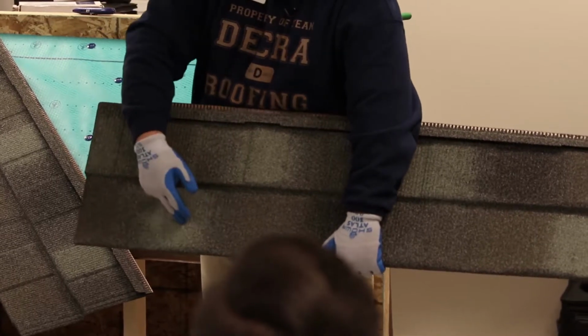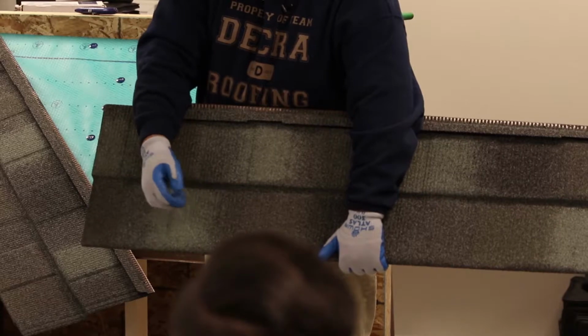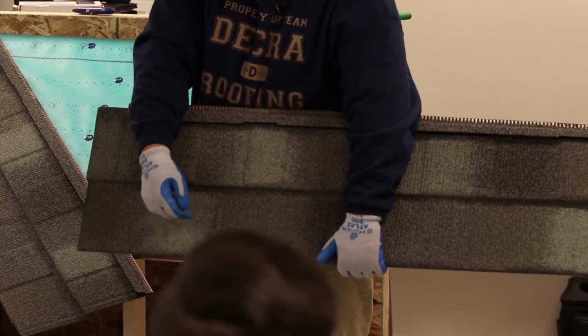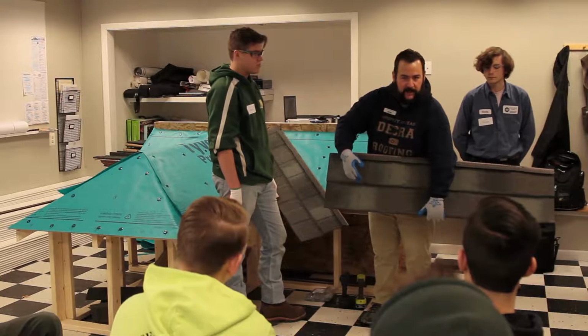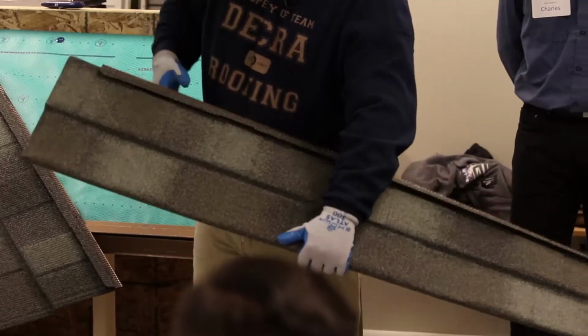You can use a marker, but if you're marking the stone coated side, it doesn't take too many scribes for the stone to rip the felt right out of the pen. Two other good options are either using an old soapstone, but a crayon actually works really well, like a yellow crayon or something like that. But for speed and ease, get an old screwdriver, any kind of sharp object that you can scribe something with, an awl, and now we can just come back and cut it off.